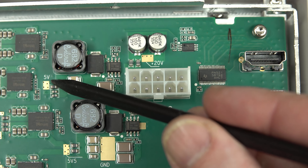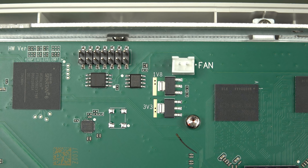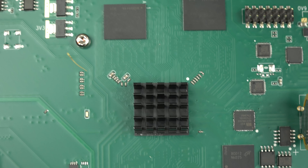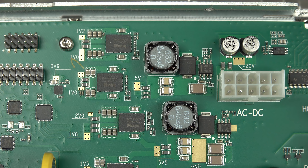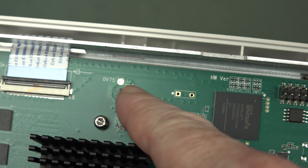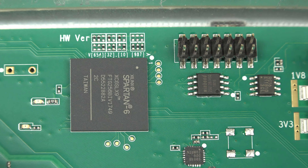And 5.5 volts and 5.5 volts — oddball. Almost forgot: 20 volt rail, a sneaky 5 volts in there, and plus/minus 15 volts — obviously for large-scale analog stuff. Over here we've got some more local linear regulation: 1.8 volts and 3.3 volts, probably for that Spartan. Tons of rails — that's the problem with modern FPGAs and chips; they just need so many different rails. It's insane.